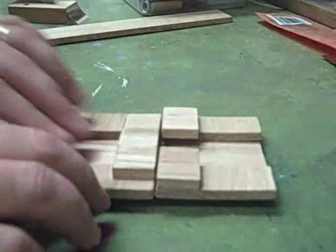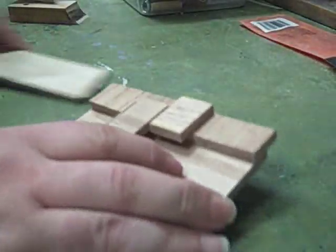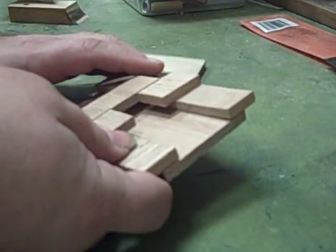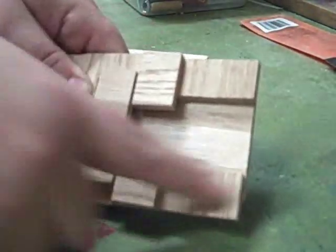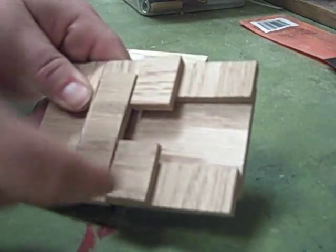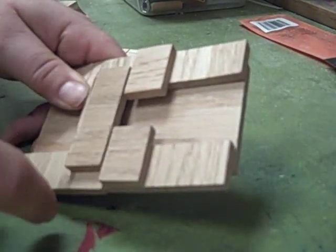What I would do is I would just put those on my fretboard, line my blade up, and make my cuts. I found that I still didn't have as true a cut as I wanted — my blade would slide out sometimes, things like that. So what I did was I modified it, and basically all I did was add a mirror jig right here, and then I left a gap right here, using two pieces instead of one. The only reason for that is so I could see my line, so I could cut on the line. Otherwise, it was hard to see the line through the gap.